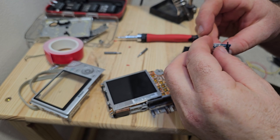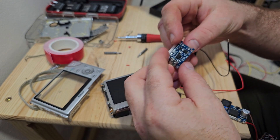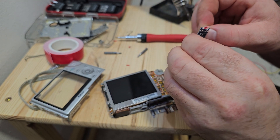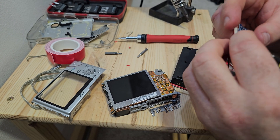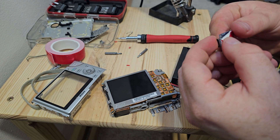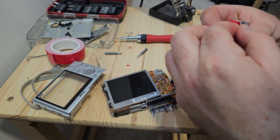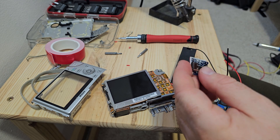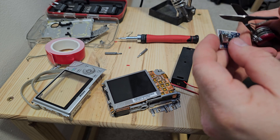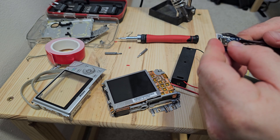When using that charging module we are focusing on five points: the OUT plus and minus, the B plus and minus, and the charging port. On the B plus and B minus we will connect the battery itself. To the OUT we connect the consumer, and we will use the charging port to charge the battery.